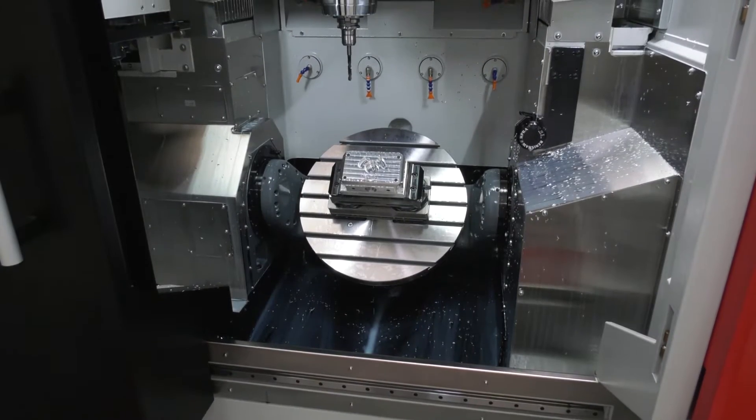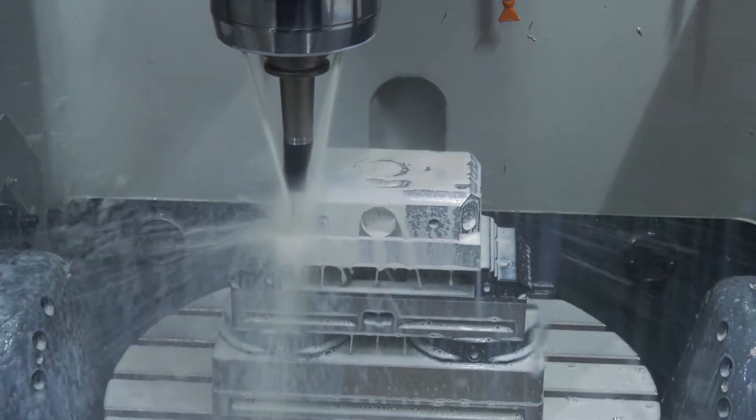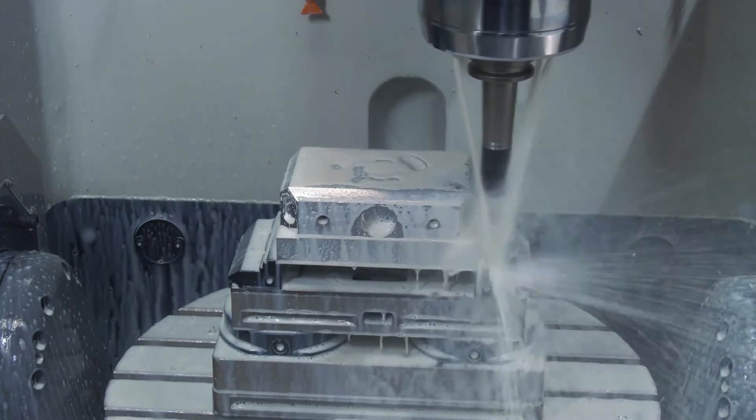With the 4 plus 1, are you standardising on some of the other features? Absolutely - we're using an LCM table made in Italy, they've got a Kessler spindle in them, and we've got options of 12,000 standard, 15,000, 18,000, and 24,000 rpm. So there's no difference in the options you can have on the machine - it's purely whether one's 5-axis or one is 4 plus 1.